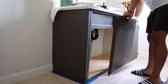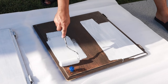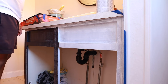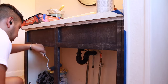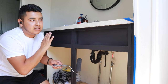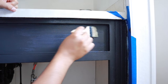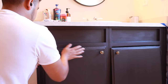The next part of the makeover was to paint the cabinet. I'm unmounting the doors just to make it easier to work with. I lightly sanded and then primed to get good coverage and make it durable. The color I went with is called Black Magic by Valspar — not too cool, not too warm. It's amazing what a fresh coat of paint can do. I recommend a foam roller just to get this as smooth as you can. I gave the cabinet two to three coats of paint, and then I topped it off with some polyacrylic just to give it a protective finish.